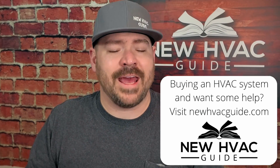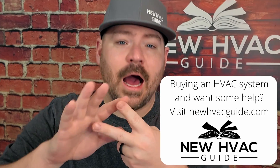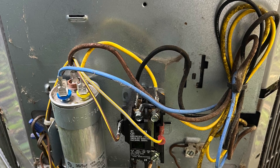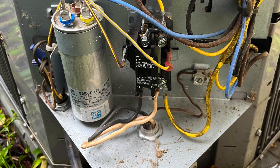Here's the challenge: if you had a straight AC outdoor unit, you actually only need two wires. That unit's only going to run in the summertime. The two wires are your hot wire — which closes the low-voltage components like the contactor, telling that unit to turn on — and the other is your grounded common, or neutral. Most guys in the trade call it the common wire. You only need two wires to tell that system to turn on.